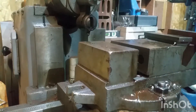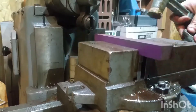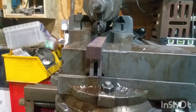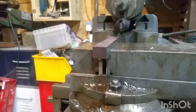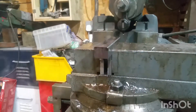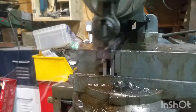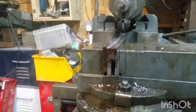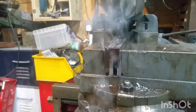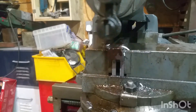I'm just swapping out some parallels to cut the other face down the sides. I've not cut any profile as such yet — I'm just sizing down the stock. I thought, if I'm going to use the shaper I might as well do all of it with the shaper and not square the material up with the mill first, because that would be kind of cheating. It's slower, but it's also kind of relaxing, and it really pings those chips off.